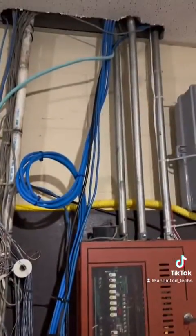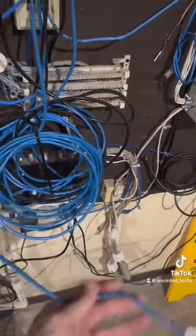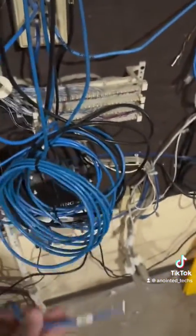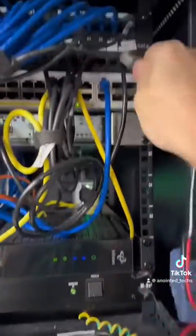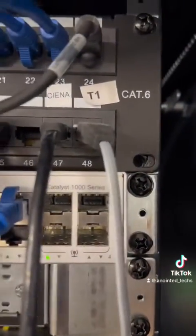I was tracing the original one, found these cables, and right here dangling is this beautiful wonderful cable that just so happens to have a label on it that says 48. Since there's a 48-port patch panel in the rack, I'm going to go ahead and tone 48 in the rack to see if it goes to that cable that's labeled 48.